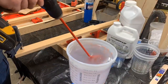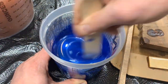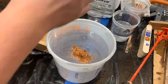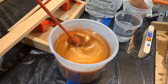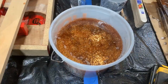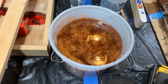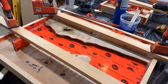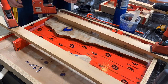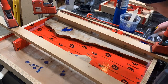Epoxy time. I went with Eco-Poxy — it was actually the cheapest and worked great. Lots of pigments: some black diamond pigments, went with some blue, and the main color was Liberty Copper. Gorgeous stuff. Do some test pieces just to decide your level of transparency. Let it sit and pop some of the bubbles beforehand, though you'll have to do that after you pour too. Dental syringes, people — dental syringes for epoxy. It gets it right where you want; they're cheap, so worth it. Especially for all those little bug holes and knots.